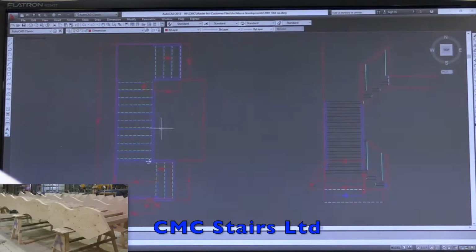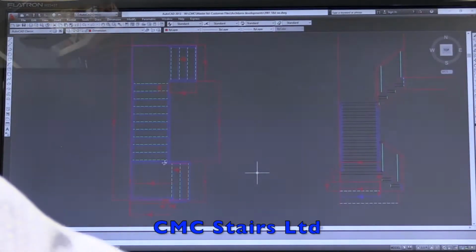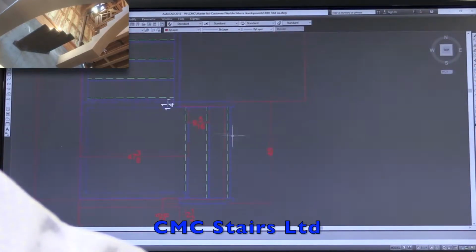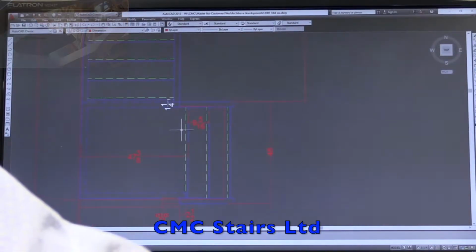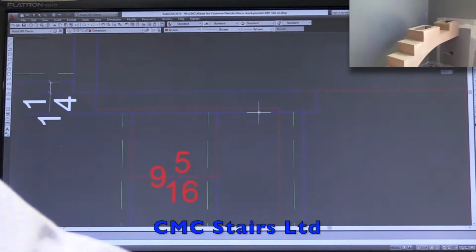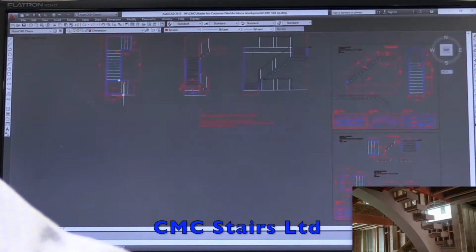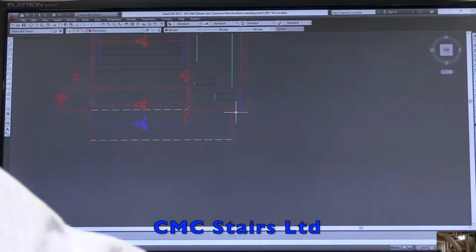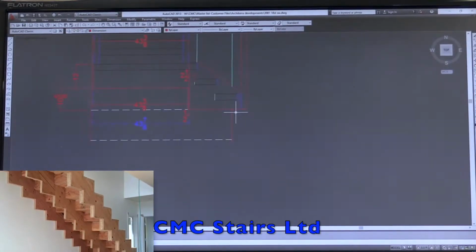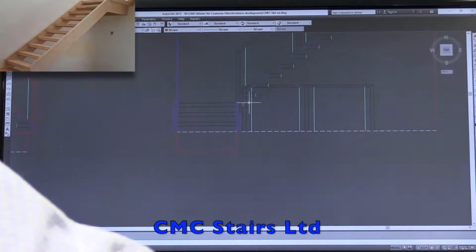So we've gone to site, we've got our field measurements, and I've drawn a top view section of the staircase and the framework and the turns that are required to the design of what we got on that job site. I do little things like inside a stringer to match to cap the end grain of the drywall on the main floor, so that those areas don't need to be finished. They can just be capped by the actual integral stair. An integral stair is a stair that doesn't require additional supports from back framing and walls. So a lot of homes, you get a stair and the landing would be separate.